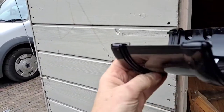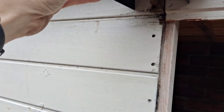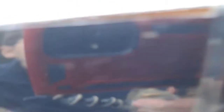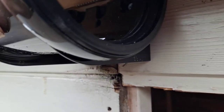I need to attach this joint here because my guttering is not quite long enough — it's a couple of inches too short. I'm going to place it where this rough bit is, then offer it up to where the line is and screw it in at that point. There we go — it's screwed in, up to the line on either side. Like I said, you need to screw these in because it acts as a bracket.